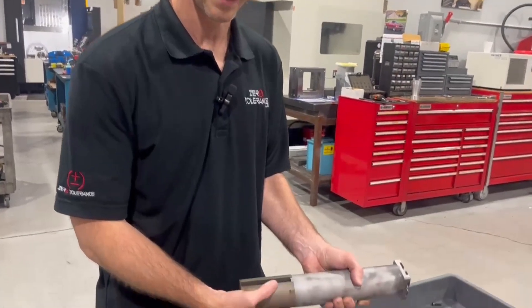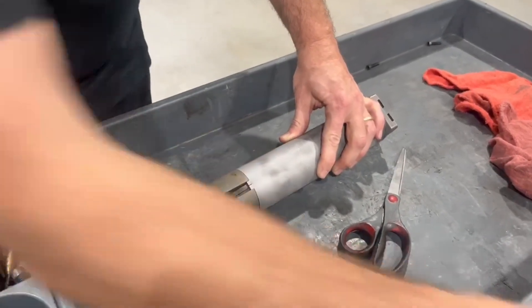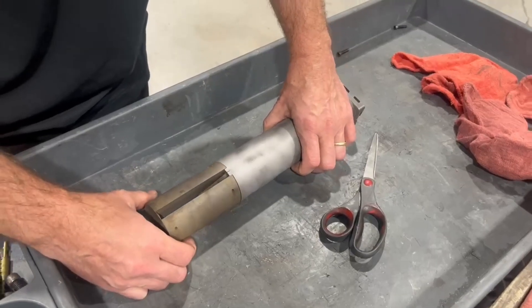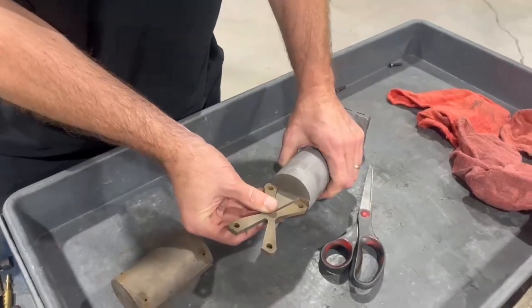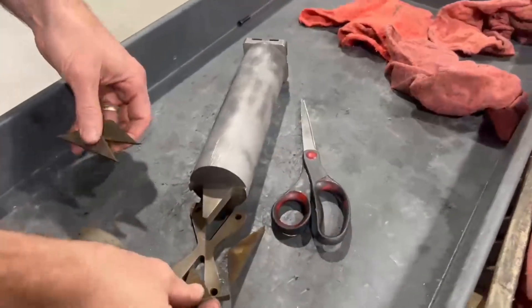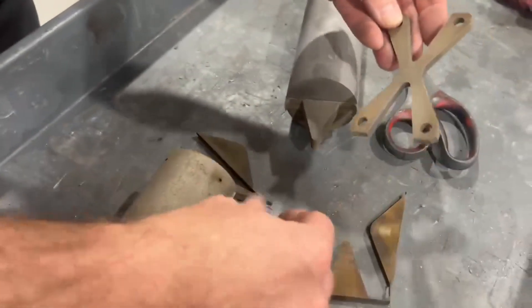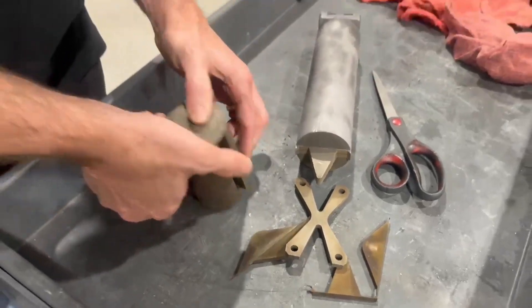I want to explain what I found to be an issue — a bad condition here. We're making a cut; I'm going to draw with my fingers. We're coming in with the wire like this, going in between these two parts. Here's what the part looks like coming out, and then it goes back out and around. It's very simple. It shouldn't take that long — maybe five hours — but it's taking nine and a half hours as it sits right now. When I'm done with that, I flip it sideways and wire out the profile. What happens then is another bad condition: you end up with this real thin condition, and if you've wire EDM'd anything, you know this is bad — it starts breaking wire and you get a bad finish on the side of your parts. So this is a bad condition all around, but it's a challenge, and the customer is wanting us to make this happen.